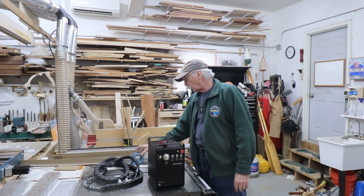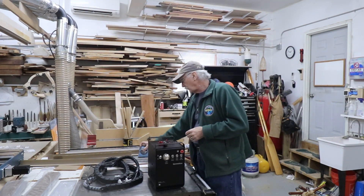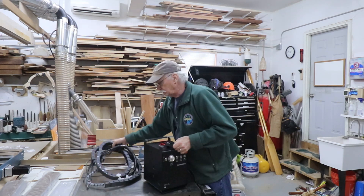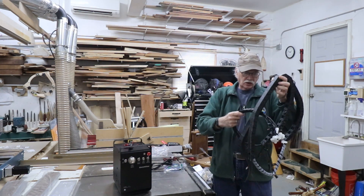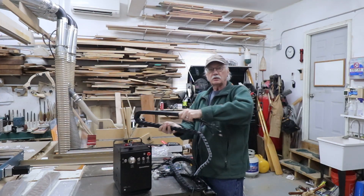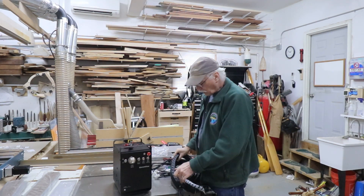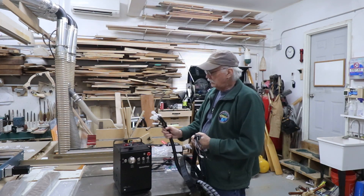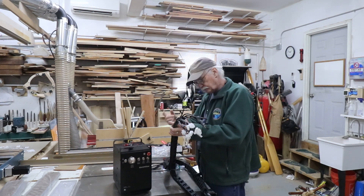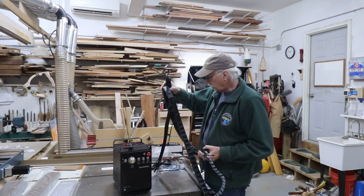Okay, power plug, power cord. This is the block to hold the Makita router if you use the Makita router. These are those dust shields I was telling you about - they go on either side, which I'll remove to do the table for the looms. And here we go - these are the drag chains. That's what they're called, drag chains. These go on the machine and as the machine traverses, they flex like that. It comes disconnected at the center point for shipping, but you can easily connect that back together. It comes pre-wired, everything is labeled, and this is the business end for the controller. This end is for one of the stepping motors, and this is for the other stepping motors and limit switches.